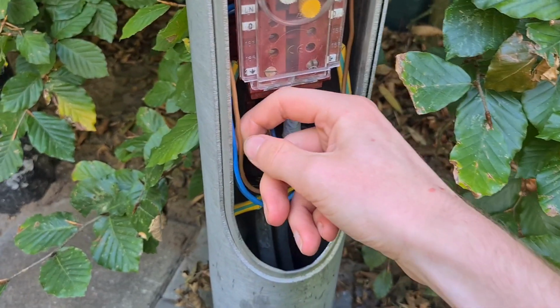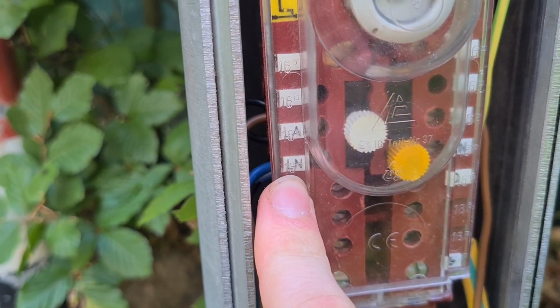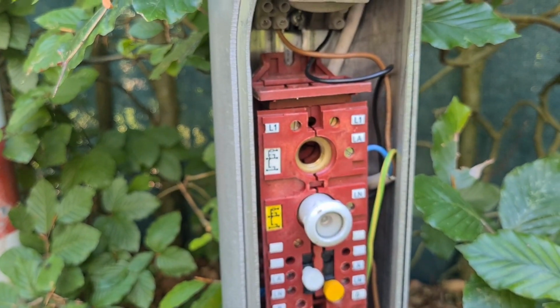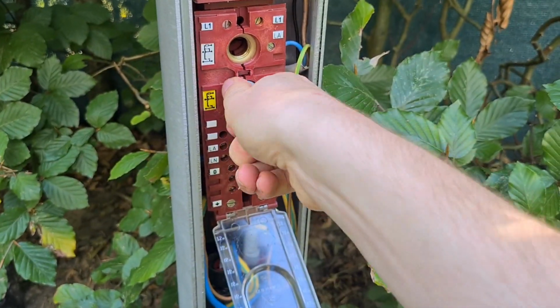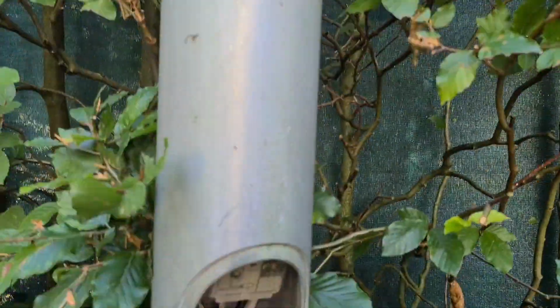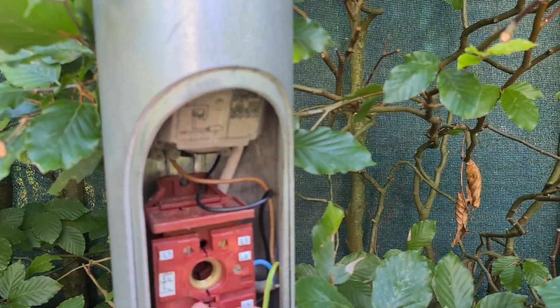We have the brown cable, which is on LA, which is the evening, and LN, which is the night. So I connected this one to the evening, and then just connect another cable in here which goes to the night. So when I have a fixture on it with two bulbs, by just unscrewing the fuse, I can turn the bulb off on one of the two, but I have an old mercury vapor fixture with one bulb in it, so that's a useless system for now, but I can still dim the poles if I want, but not in the way it's supposed to be.